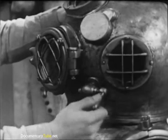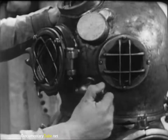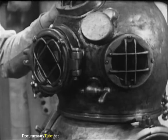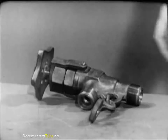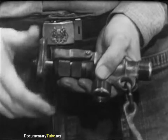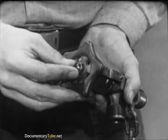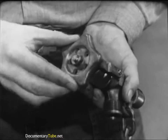Next, the spitcock at the left side of the helmet. This is a secondary exhaust valve used to make minor adjustments in the diver's buoyancy. It's a simple sleeve valve. The only test necessary is to operate the lever, making sure that it has enough turning resistance to remain fixed at any setting. Now let's look at the remaining two valves, each concerned with air supply. The air control valve regulates the amount of air admitted to the diving dress. The regulating hand wheel should turn freely so that the diver has no difficulty making adjustments in his air supply. However, it must not be loose. Enough resistance must be felt to prevent an accidental bump or blow from turning the hand wheel and thus altering the diver's buoyancy.